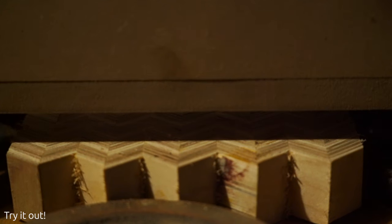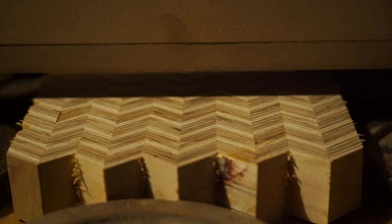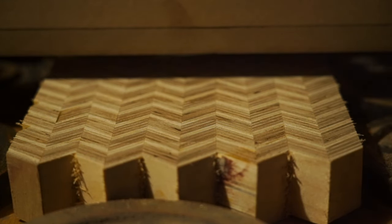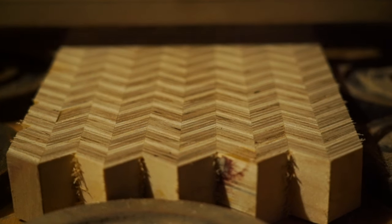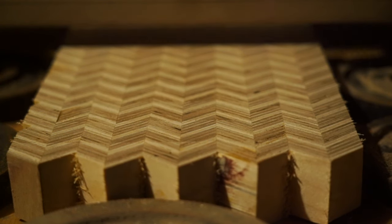One incredibly important thing is that you make sure that your piece that you're going to plane will not move. In this case I put weights around the wood and ensured that my planing bit will not contact those weights, because that would be bad. Once you've locked that piece down, you can take passes in the correct direction that your router specifies and try to take off as little wood as possible in the beginning just to get a feel for it. You can take off one to two millimeters with no problem, and you'll find that you have an extremely smooth piece of wood afterwards that only needs a little sanding to get it to its final destination.